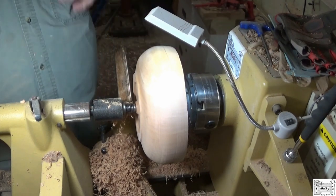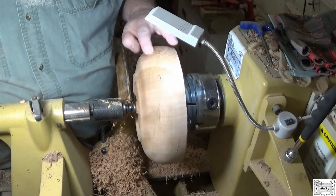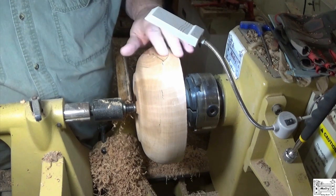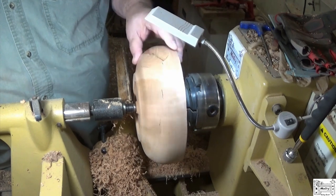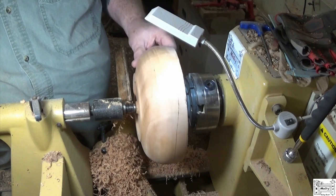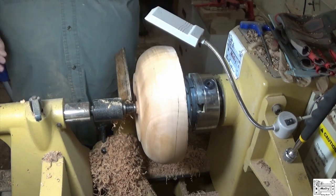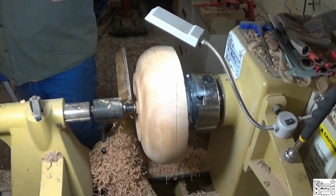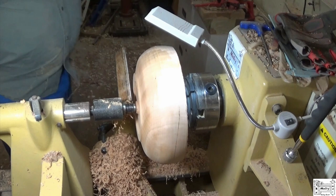When it's all said and done and I get it finished, I'll probably fill any voids with colored epoxy or something. This is the one that worries me right here — some people call it ring shake, some people call it wind shake. More often than not, something like this was probably a crotch — a limb was growing out of there. What happens is the trees, especially if they're growing out by themselves, the wind has a tendency to whip them around and it causes wind shake — the grain separates inside the tree. And here in Texas, we have a fair amount of strong winds.